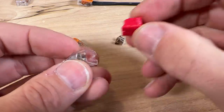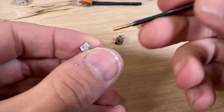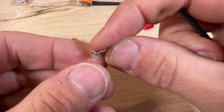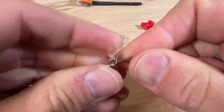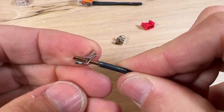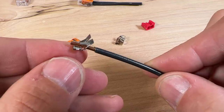The second reason is associated with how wires are actually held in place. With the Ideal connector, if I break off the two tabs and pull out the insert, you can see two different components: the bus bar, which connects your wires together and ensures continuity, and these little lever arms which are what actually hold the wire in place. It's really just a bent piece of metal pressing the wire down onto the bus bar. People call out the surface area, but that's more than enough to carry a load — I just don't prefer this retention mechanism compared to the Wago.